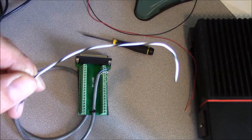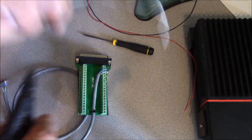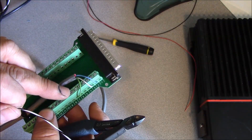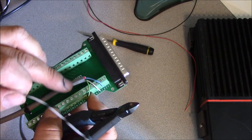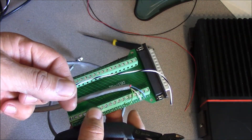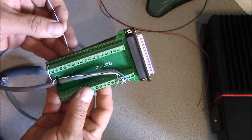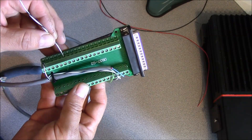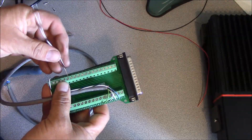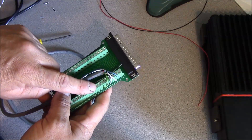Now we'll go ahead and make our jumpers out of this wire that we pulled out of the multi-conductor cable. It's quite a run in this particular connector. This first jumper is going to go from the CTS pin to the RTS pin and short those two together — from pin number 6 to pin number 20. You can see we have our RTS and CTS jumper together now. We're going to go from pin 25 to pin number 8 with the same kind of arrangement, except when we get to pin number 8, we're actually going to tie in a power lead to that one.